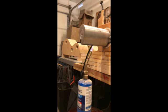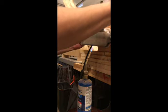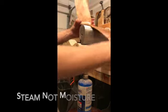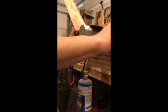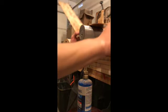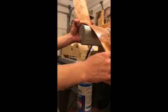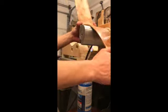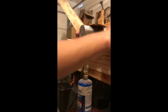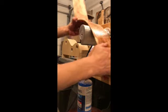I'm going to give it a spray — in the bottle is actually hot water. Hot water, in my opinion, is a lot more helpful than cold water. It really helps to keep the moisture going. I'm going to keep rocking it. I'm not letting the sides support the weight of my hands and arms — I'm letting gravity pull my hands down, but I have control. I want the heat and the steam to allow the wood to bend with grace and ease, rather than the weight of my hands.